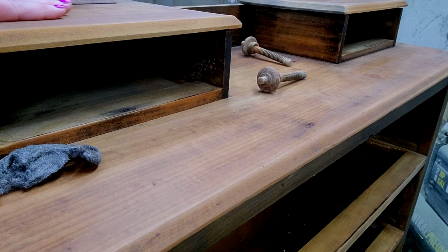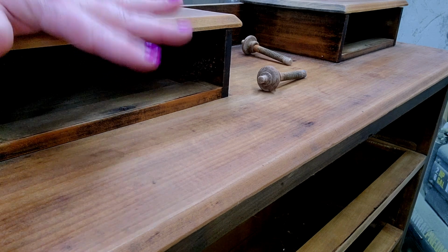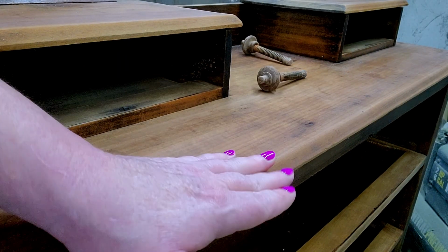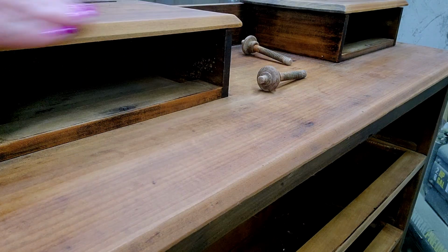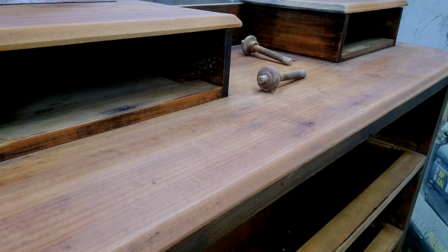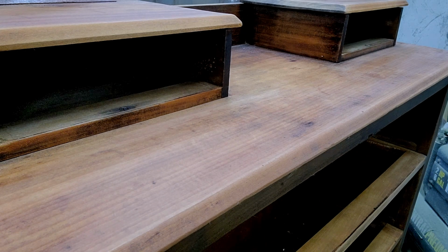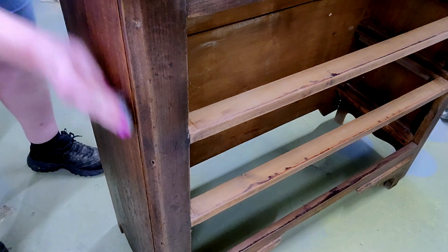When you go the route of spraying shellac, you want to do really light coats. That way you don't have any runs. After, you're going to have to go through with steel wool and sand down every surface, but not putting a lot of pressure, just taking off those nibs. The first one is going to be quite rough. It's going to feel quite rough. It's kind of like doing just a prep coat on that first spray, and then after that, you'll start seeing that it's a really nice smooth finish.